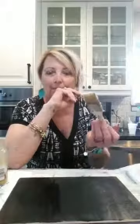Okay, so we're just going to be putting some of this on here. And I find that if you use the spray shellac, maybe I'll open up a window and I'll show you, but I find that if you use the spray shellac, you get more of a finer mist, so you get more of a fragile crackle. If you use the brush on, you can really puddle it on there and get some big cracks and chips.